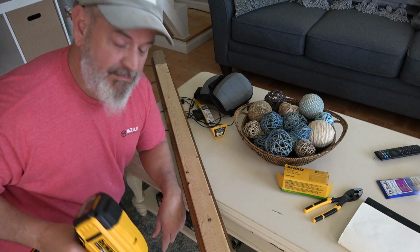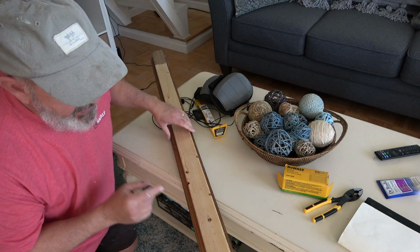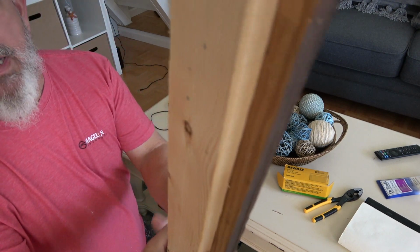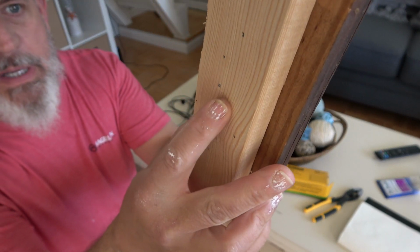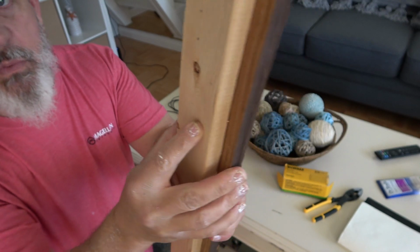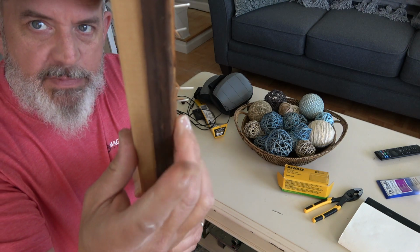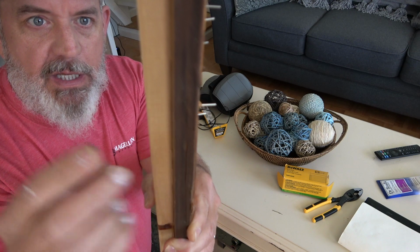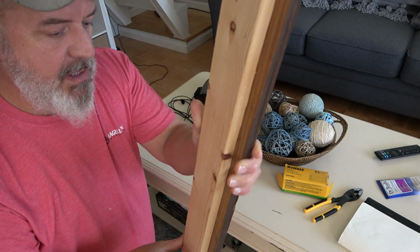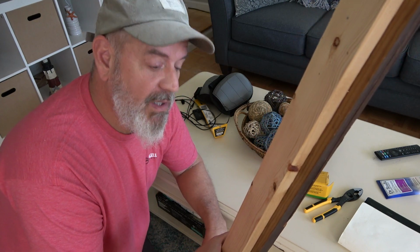This is a cool gun. This is a really cool gun. I really like this thing. Again, the first time I shot it, let me show it to you. So the first time I shot this nail, you can see the nail head sticking out about 1/8 of an inch. So I just rolled that forward and it's countersinking perfect without marring up this wood. You can see this is a 2-inch brad, and this is extremely hard, old, some kind of cedar, and this is obviously a fir or a pine strip here. And let me tell you what, I will no longer be able to get these boards apart. It holds incredibly well.